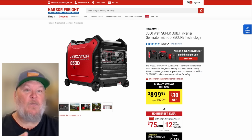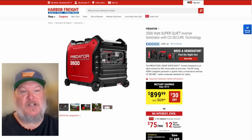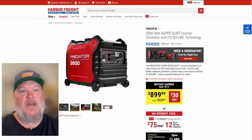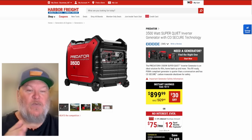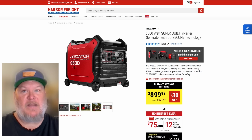In fact, I gave him the option between this and another one, and he chose this one because he loves Harbor Freight so much. He had the one that's a step down from this, and it just wasn't enough to run their AC and everything. But he got this one, and he got a soft start on his ACs. He's got the 15,000 BTU, he's got two or three of them. He's got a car hauler or toy hauler fifth wheel, and he got the soft start installed on the ACs.